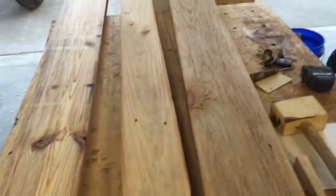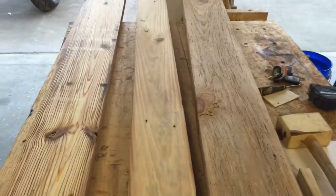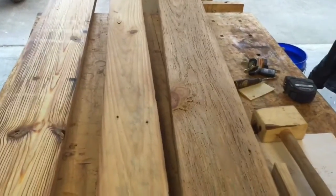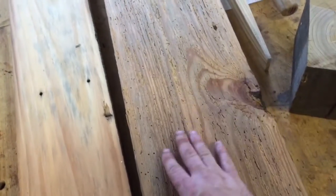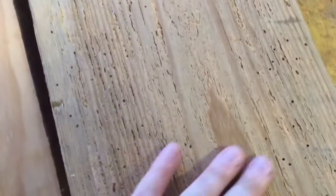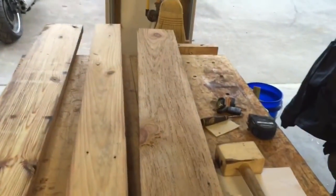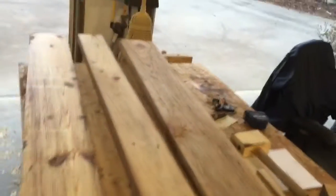Other boards, like this one here, have pretty fair grain — not a lot of knots and not a lot of pitch. It's easy to work with, cuts like butter. This one here will probably cut pretty easy too. You can see there's a lot of pitch in certain areas but it's washed out in others. The wormholes kind of reduce the density — it just makes the board a little bit lightweight.